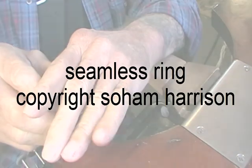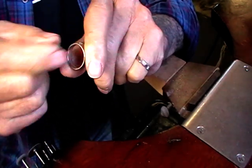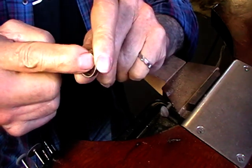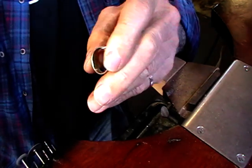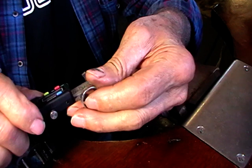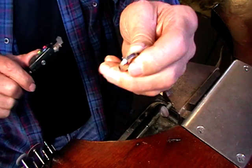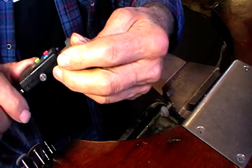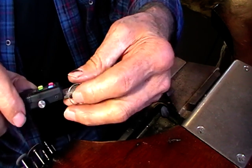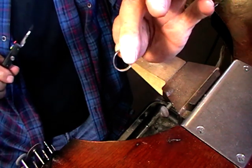During the let's make a seamless ring experiment, I found that the thicker the material, the larger your beginning hole will get. This coin started with a 13 millimeter hole and it ended up 18, so that's 5 millimeters bigger. The 1 millimeter started with a 16 hole and it ended up being just over 18. So you'd be closer to your size.